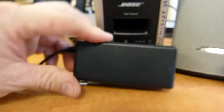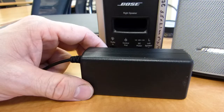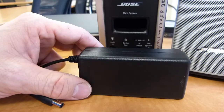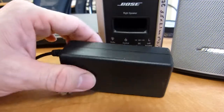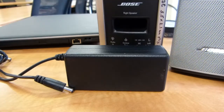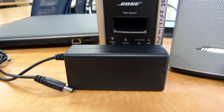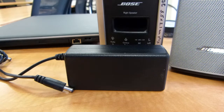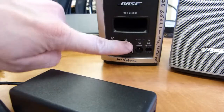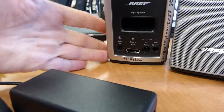So you need to find a converter or a power supply unit that makes 18 volts exactly and 2 amps or more. The rule with these rectangular units is that the volts must match — absolutely must match — and the amps should match or could be more on the power supply unit than what your equipment is needing.